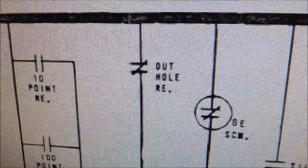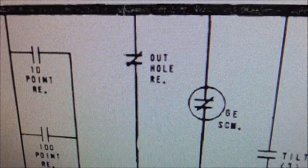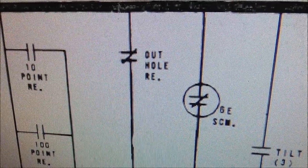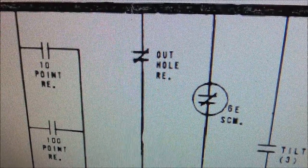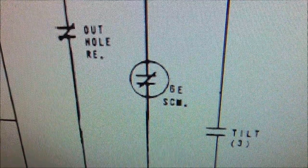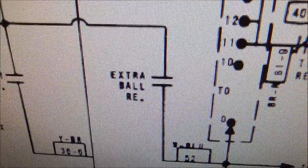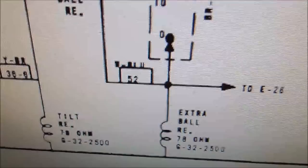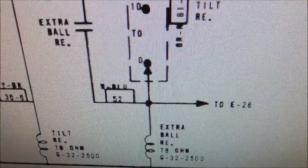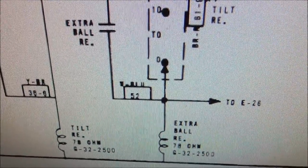But it also gets power through the out-hole relay. So if the out-hole relay has not been turned on, then it will not kill power. So if the out-hole relay has been put on so that it opens that switch, and the score motor turns around till that switch opens, it will kill both of the sources of power so that the extra ball relay can no longer hold itself on and it will turn off. So for whatever reason, it's doing it after the ball goes through twice, which is interesting. So I think it's a timing issue where,